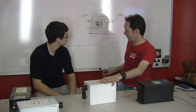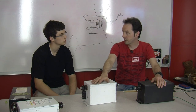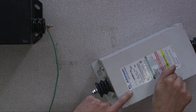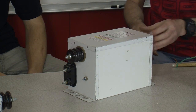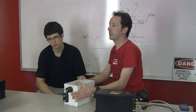These also have all that inside, but a lot of the newer ones have an extra thing, and the extra thing sucks really bad. You can see our high-voltage terminals, the bushings, because it's where it passes through into the box. It's not just a terminal. It doesn't connect to the box. The insulator touches the box, and the wire goes through a hollow tube. So this isn't an insulator. It's a bushing.